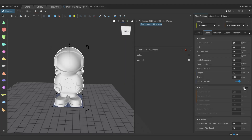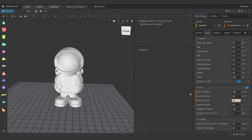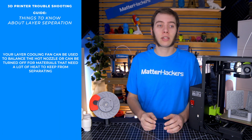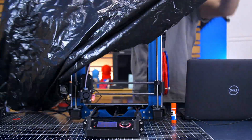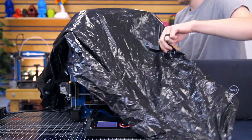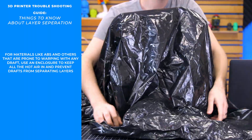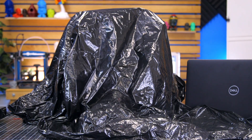Some materials don't really like the layer cooling fan, like ABS, nylon, or even PETG. You may need to lower it to as low as off, or maybe as high as 33%. It's something you've got to experiment with because it goes with the printing temperature — you can print really hot and turn the layer cooling fan higher to counteract it, or in some cases you may just need the layer cooling fan completely off. If you have your 3D printer in a draft environment, get an enclosure. That can be as simple as a garbage bag you've cut up and put over your printer, a cardboard box, or an enclosure kit that you assemble over the entire printer to help keep the hot air inside and the draft outside. It makes a big difference even just having that trash bag.